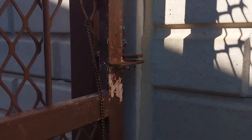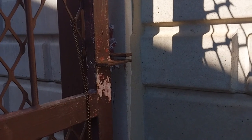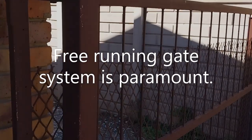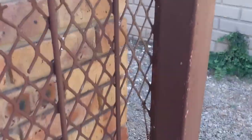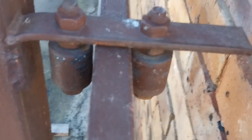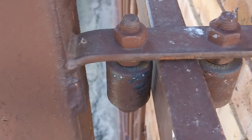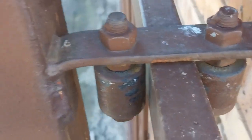The first aspect we are looking at is that the steel sliding gate is free running. Sliding gates normally slide into gate guides at the front, which keeps the gate in place. These guide brackets should not cause an obstruction in the movement of the steel sliding gate. Next, the gate roller guide system — both guides should be free running as well. They should not be pinching the steel sliding gate, and there should not be any excessive distance between the roller and the gate.